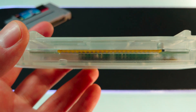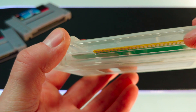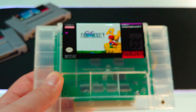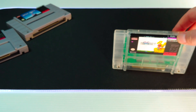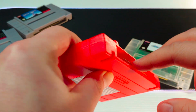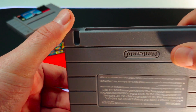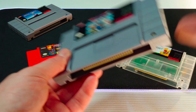Let's take a closer look at the edge connector. It is beveled and chamfered, which means it's not going to destroy the pins on the cartridge connector like some other repros or clones might. The multi-cart one is beveled but not chamfered, which could cause some issues long term. The Dragon Quest one is kind of chamfered and does have that bevel, so that's a good sign.